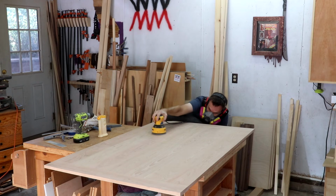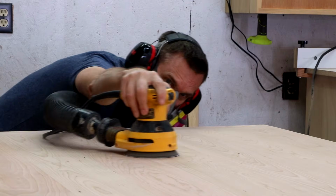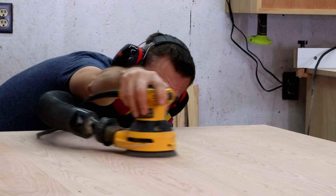We sometimes think the only purpose of sanding is to remove gouges, scratches, and other rough spots. And while these are important, try not to think of sanding as a spot procedure. The entire project needs to be sanded in order to achieve a good finish. Treat the sanding phase of a project with as much attention as you give to making accurate cuts. Probably the most neglected parts are wide faces, say the top of a table or the sides of a bookshelf.